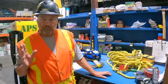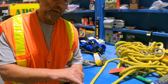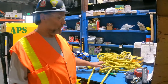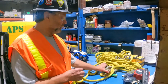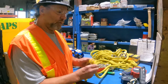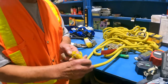Another item — from what we can tell this came from a storage issue. This is a horizontal lifeline. Jeff and I looked it over; something hot got put on this rope — we can find singe marks and places that are hard like it was melted. This horizontal lifeline is a 100-footer that costs just over $600. We know what job site it was on. If you put this up without realizing it was frayed and your life depended on it going over the edge and it didn't hold your weight, it's not fall protection — it's a guaranteed injury or death.